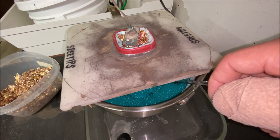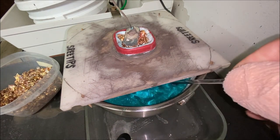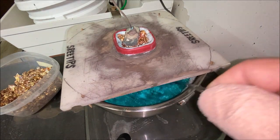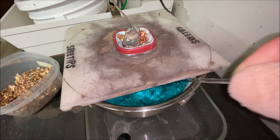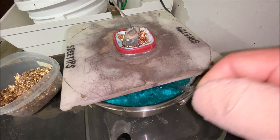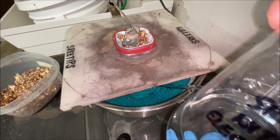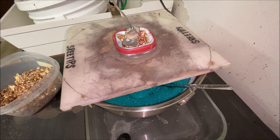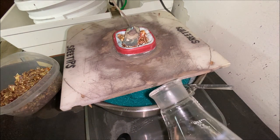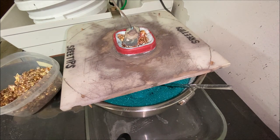I hate working around the silver cell without any gloves, but they cut a bump off my thumb yesterday and I can't get a glove on this hand. I keep a glass rod in here to stir up the electrolyte. As the cell operates, the silver in the electrolyte gets depleted — it gets plated out on the inside of the stainless steel bowl, which is the cathode. If we're not careful, we could get some copper depositing out with our silver unless we keep the liquid moving and keep the electrolyte silver concentration up.